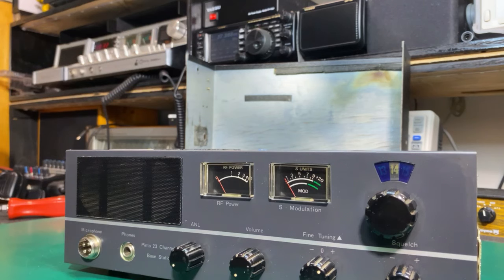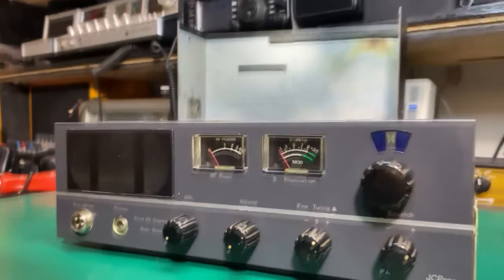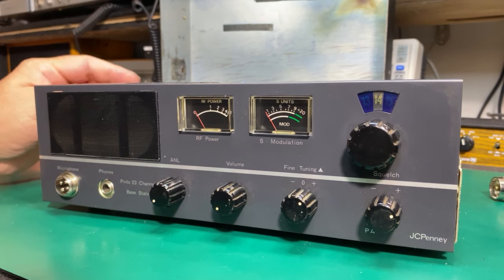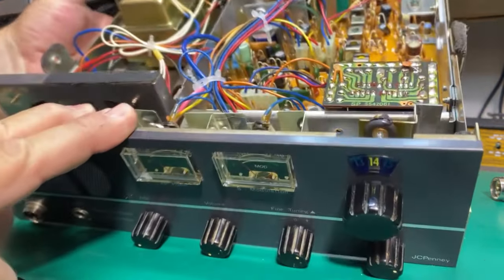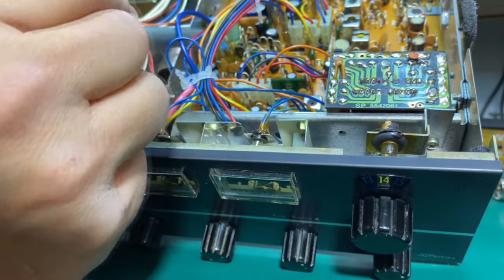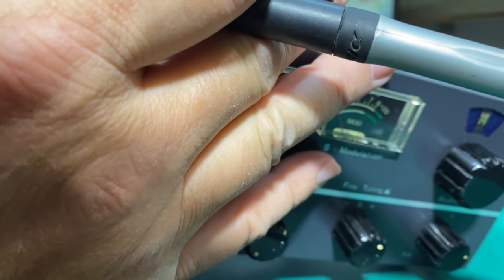Okay, so here's what I'm going to do. I'm going to let this percolate for a couple days supervised. Generally, when I let the 12-volt mobiles percolate for a while, sitting on the bench and running, I'll leave them on 24/7. I don't really care about that. However, because this is an AC power supply issue, there's that big old Nippon capacitor in there, which is a quality cap. I don't want this to let go at night or something. And these are Nichicon caps. Yeah, look at that. That's pretty cool. And this one back there is a Nippon Chemi-Con.